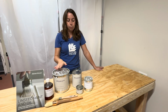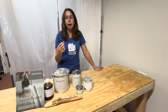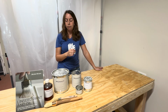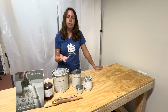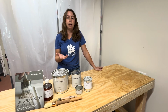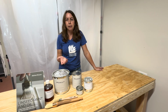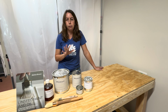I use a system with a priming system and then paint to produce something that looks like a high gloss finish, and it never has to be repainted. Actually, some owners would like to. After about 10 or 15 years, you may see that the gloss starts to break down and you get more of a chalky finish, but all you have to do to renew that is rub on some new boiled linseed oil, every year ideally, but if you're doing it every few years, you should definitely see the benefit. And once it is time to paint, let's say you want to get a truly glossy finish back, or perhaps the color has faded a bit, then all you need to do is clean it up, one more coat of linseed oil, and you're ready to go. You never have to scrape back again.